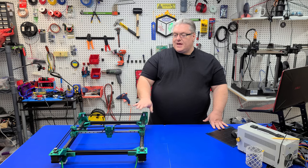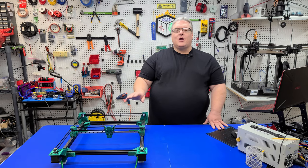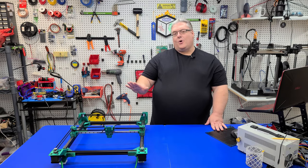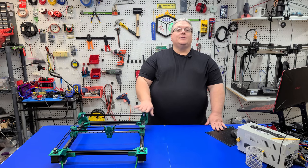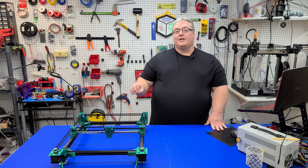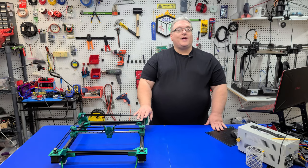The other benefit of reusing this motion system was that I could really focus on building the laser part of the project. What I've got here is a motion control system on an open frame, so we can make this into anything. We're doing this as a laser cutter to start, but I'll also make different heads so I can attach a vinyl cutter or a plotter — essentially three projects out of one build. In today's video, part one, we'll assemble the frame, install the linear rails, steppers, and belts. The next video will cover the electronics using Marlin firmware.